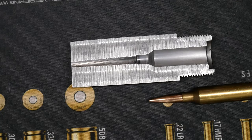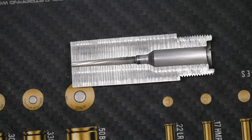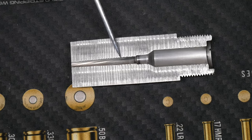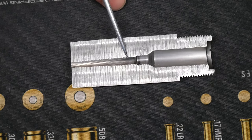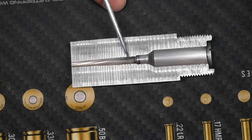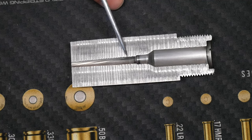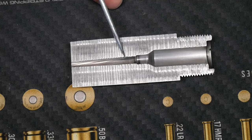One other interesting thing you can see cutting these apart is actually the erosion of the throat. Basically every time you shoot the gun, that heat, pressure, and friction is having an effect on the transition point of the bullet and the rifling. You're actually eroding your barrel slowly over time and pushing that transition point and where that taper starts out further. Doing some measurements on this barrel, I found I am getting about seven thousandths of an inch of throat erosion for every hundred shots.